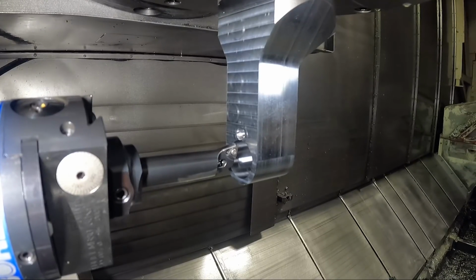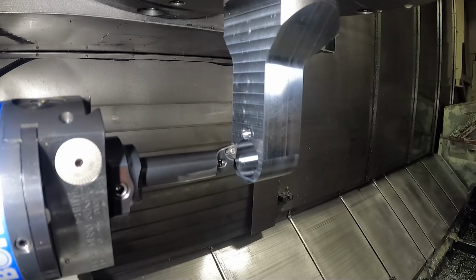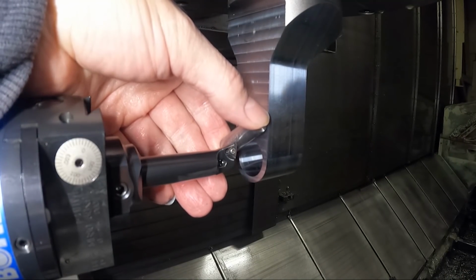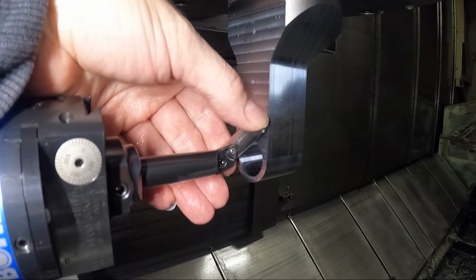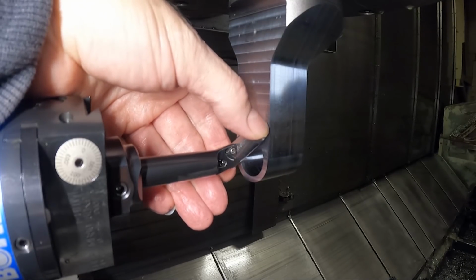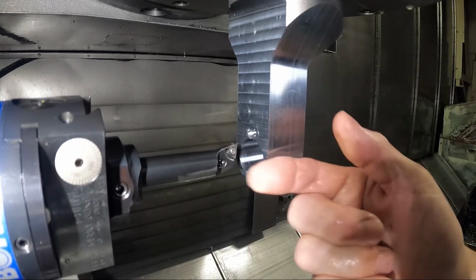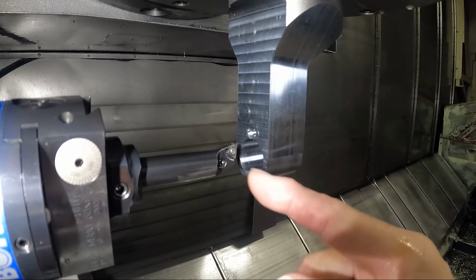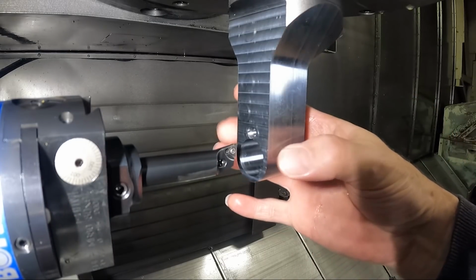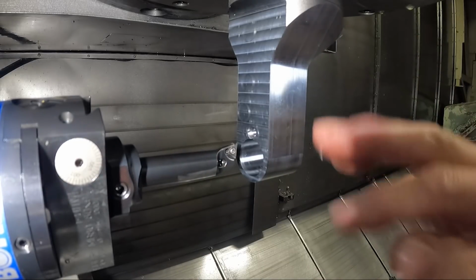So now what I have to do, I think first I'm going to set my Z offset. What I'm just going to do is take a gauge pin. I'm going to set the zero right on the face of the tool here. The machine doesn't know that I'm doing this backwards. In reality, I've set a length on the tool in the CAM software so that it would think it's boring a hole in a piece of material with this tool here by turning the spindle, but I'm actually doing it in the reverse. But it doesn't really know any different. It's gonna come down here and bore back 1 1/8 inches into this thing for my little spindle cartridge thing, and it doesn't know any different. It just knows the movements, even though I've reversed the setup here.